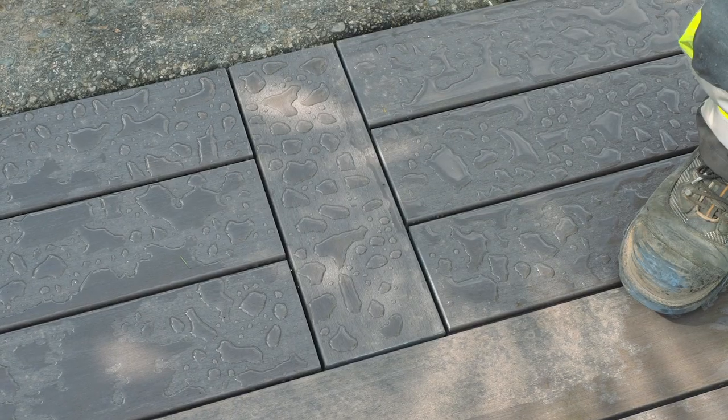These boards aren't always going to be square, so consistent gapping is important. I don't gap a board 3/16ths in the field and then change it to some other size gap somewhere else — I like to gap everything the same. In this particular build, we have a 20-foot center inlay, herringbone patterns at every corner, and in the middle of each herringbone run we have a breaker board — a seam board, a soldier, whatever you want to call it — repeated on every run. When you take an overall look at the dock, everything is in unison, everything breaks intentionally and purposefully.